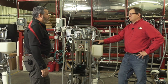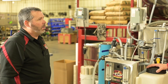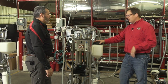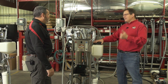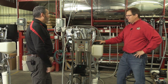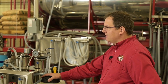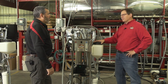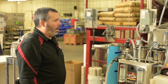After we're done that desugar cycle we go into a rinse cycle. During the desugar cycle we're flushing all that syrup out of the machine. On a small machine there's not that much sugar — probably only four to six percent somewhere in there. But on a big machine it could take 15 to 20 minutes to completely desugar the machine, and you could lose a lot of syrup if it just gets flushed down the drain.